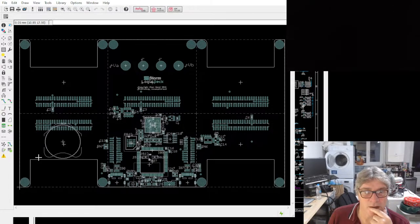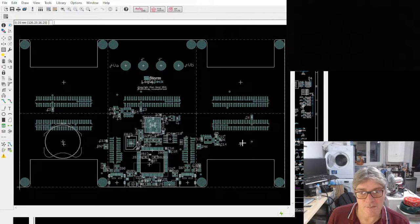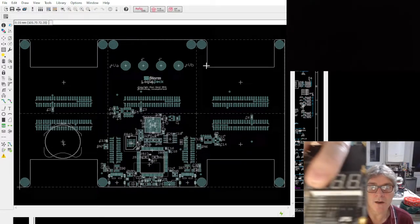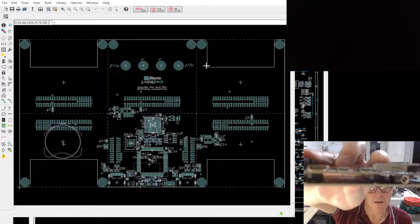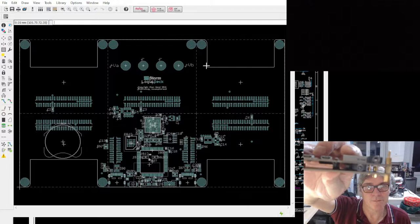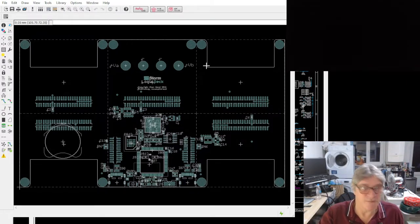Notice 4 and 5, both of those have cuts in the outline at the top. The reason that I do the cuts is to allow for taller components, because in many cases the tile, in this case, this is not a good example, but the tiles here, everything's on top, but normally the components will be on the bottom of the tile facing down to the board. Okay, but some face up, some face down. But if you can face them down,